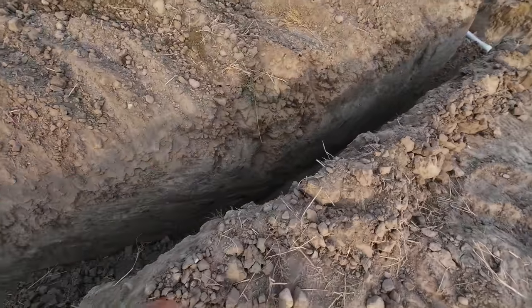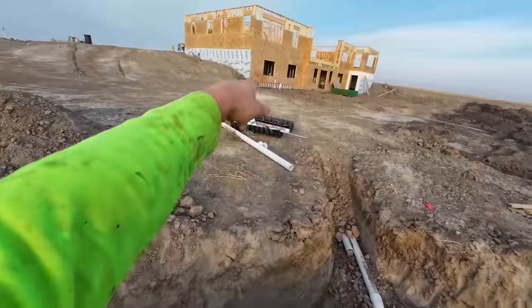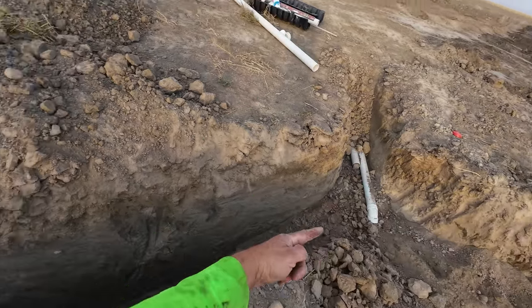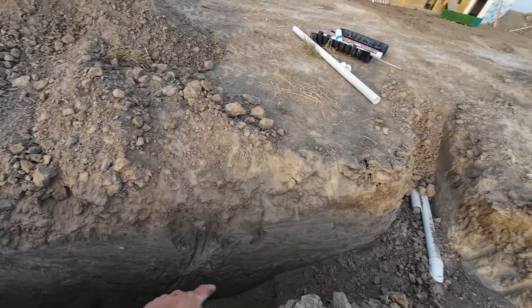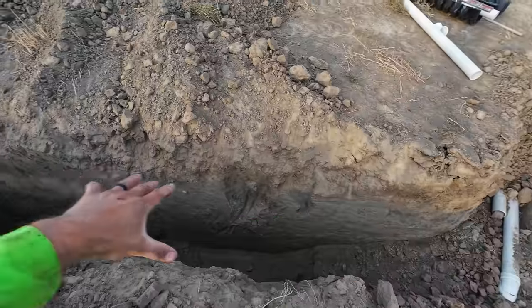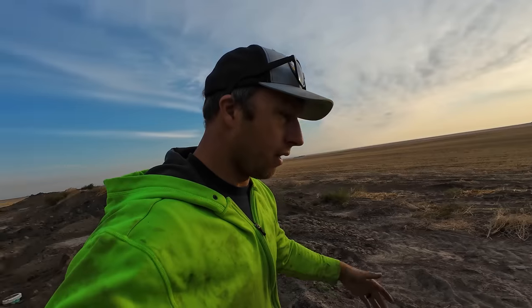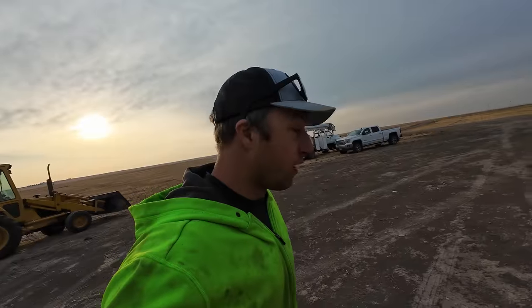I dug a big trench here - good six, six and a half, maybe seven feet deep, 30 to 40 feet long - for that drain tile line that wraps around the whole house and comes out here. I've got two extra chambers left, so I'm going to take the line, drop it down, get a bunch of field rock from the pile just over the hill, fill it in, carefully level it out, then take those chambers, put them on top, run the 4-inch schedule 40 underneath with road fabric around the sides to keep dirt out, road fabric across the top, more rock, and bury it. That way if there's ever a rain event or water leeches along the foundation it'll fill that chamber and leach into the ground - not into my basement. I'd rather have this than a soggy basement.